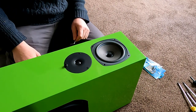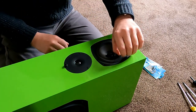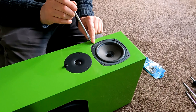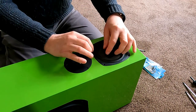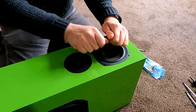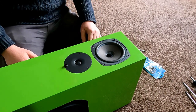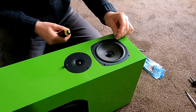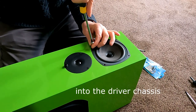Except when you want to replace the driver. There's no way this is coming out by itself — it's still completely glued in. The thing you do not do is get your screwdriver down the side and start trying to lever it, which I've seen a lot of people do, ending up with big gouges all around. If the driver is completely destroyed like this, it's not inconceivable to take the cone out, get mole grips on the actual chassis, slightly distort it and it'll pop out — but there's quite a certain amount of risk involved. The best way is to find a screw of the right diameter and just screw it in — not too far, just enough till it bites.